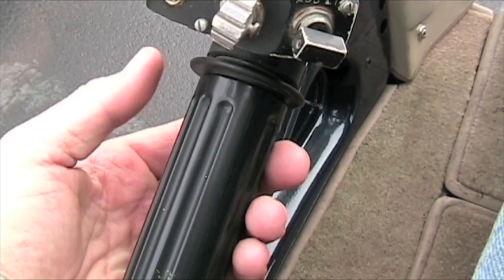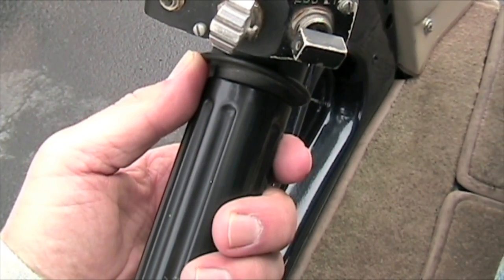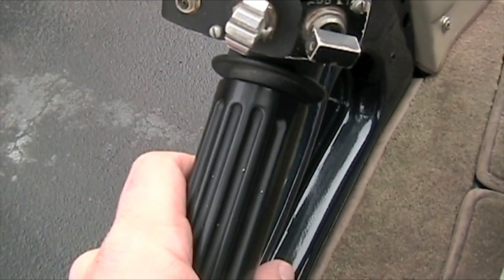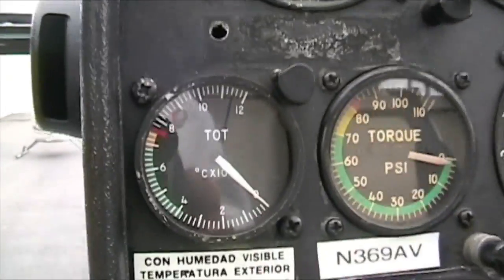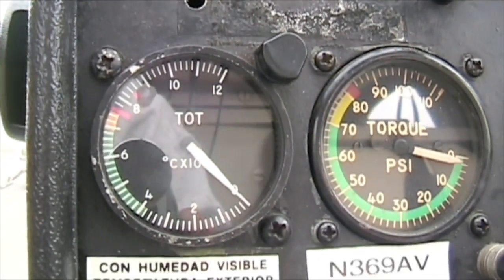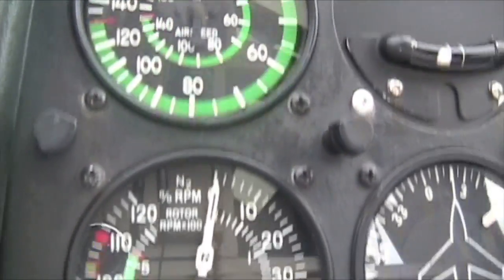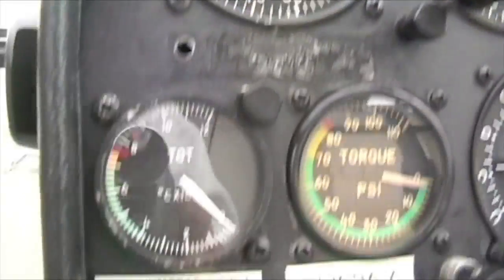For the cool down, since you're letting it cool down at idle, you're going to push the lockout up and cut the fuel — nice, good snap. Snap it closed. When you do that, look at these three gauges. Since you cut the fuel off and there's no flame in there anymore, your turbine outlet temperature will decrease, your N1 will spool down, and your needles will split on your tachs.